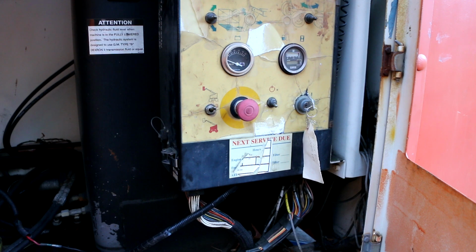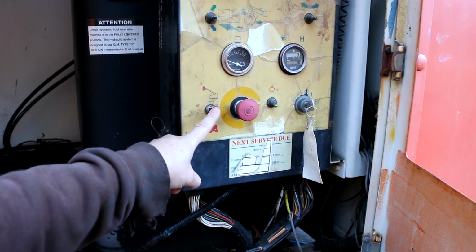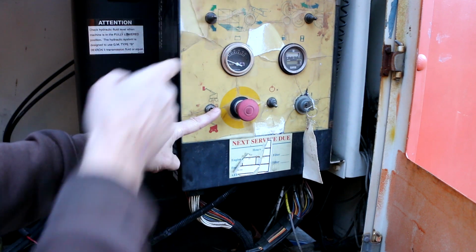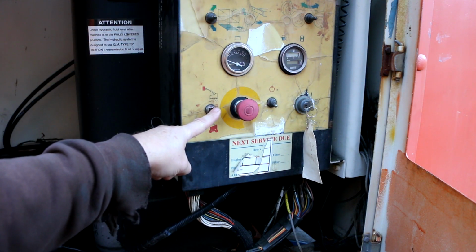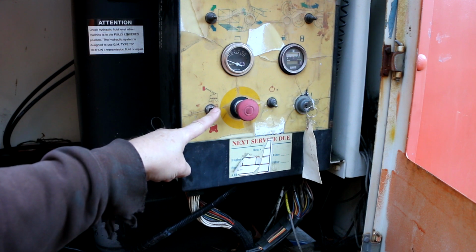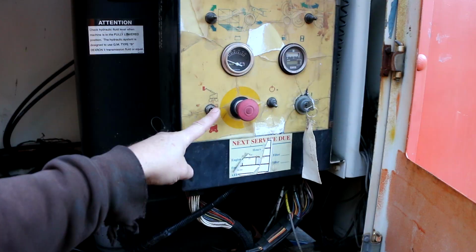Swing left started to just barely move, which it's been doing, but then swing right did absolutely nothing. But I'm wondering what happened with these lights while I was doing that. The last thing I did before I shut it down was actuate this toggle switch down, held this spring loaded, which then puts these controls in play, and I operated those toggle switches to see what happened, because it does swing from down here. So now I'm going to review the footage and see what it did.